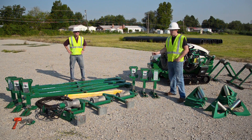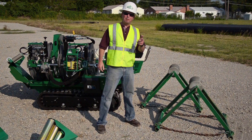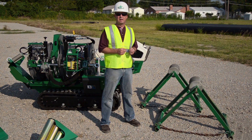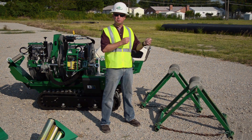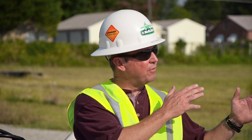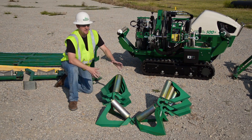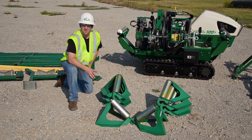This is the Polyhorse with Power Assist. We're using this on the job site today because of its gains in speed and productivity. It's effectively like a speed loader for loading pipe into your Fusion Machine. For a job like we're doing today, pipe stands are a must-have accessory. Pipe stands are going to save wear and tear on our machine as well as help the alignment of pipe in and out of our Fusion Machine. You want to have at least two pipe stands to hold the pipe in line with the carriage of the Fusion Machine. Normally we put a pipe stand on each side of the machine, 20 feet or so away, but since I'm using a Polyhorse, I don't need one on the loading side. Instead, I'm going to take both pipe stands and put them on the exiting side of the machine. These are low profile rollers — strung together in pairs and laid along the ground underneath the pipe. These are going to prevent the pipe from contacting the ground and getting nicks and gouges.